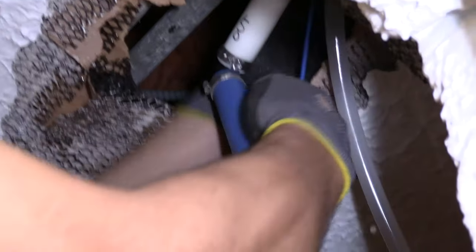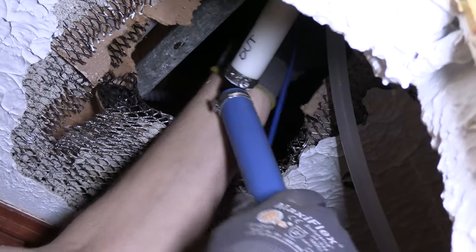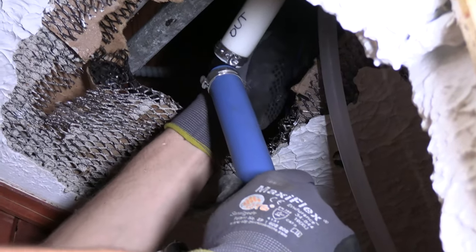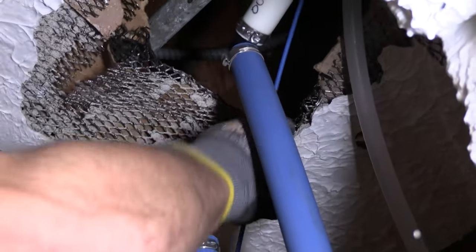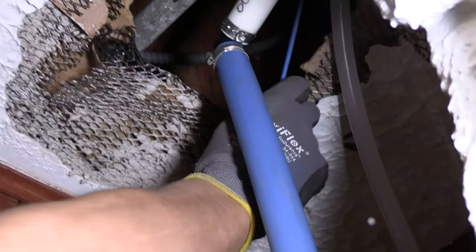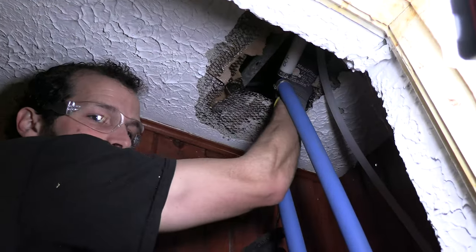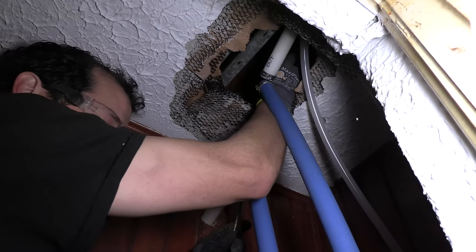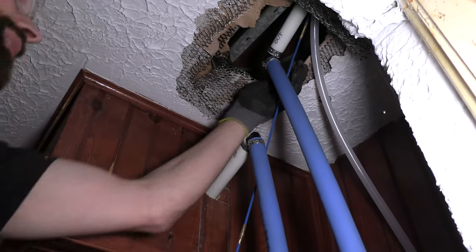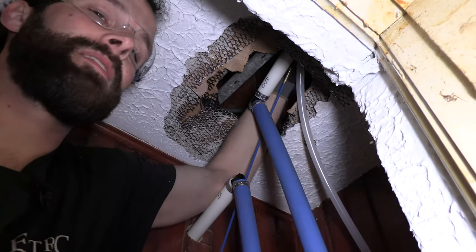About 25 feet of wire length for this whole job, going from one room in the basement to the next. It's hung up — I'll turn right to avoid undoing fish stick couplings. It's pulling smoothly now. I don't want to pull hard or yank — that Romex wire is sensitive. I want to get this install done without damaging the outer jacket. If the jacket is substantially cut through, I'll have to splice it at that location.